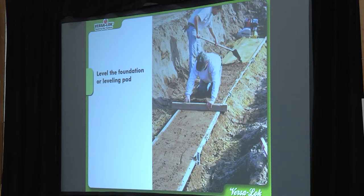One step that I don't do — a lot of guys screen off a little bedding layer of sand. It's not as critical as with pavers. If you're going to use sand on a retaining wall base, you don't want fine mason sand — you want something with variation in size and angular aggregate because it's going to reduce or eliminate washout underneath your wall base. Personally, I go rock all the way up and set my blocks with an 18-pound sledgehammer. I personally feel better about having the rock come all the way up, but it is an option and does speed up leveling.